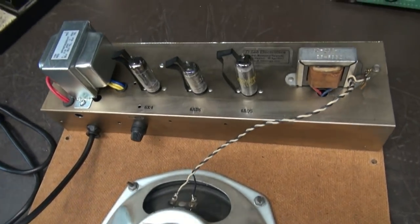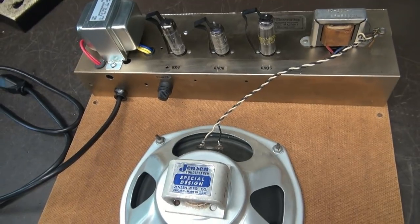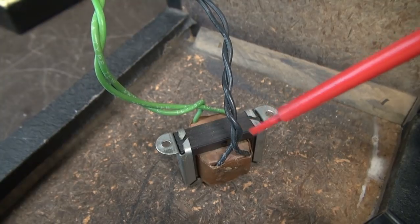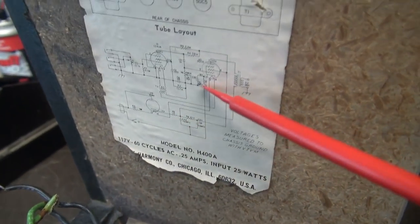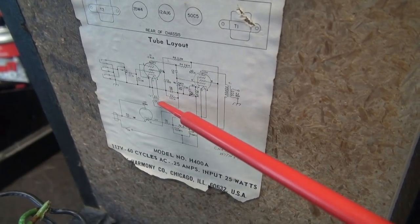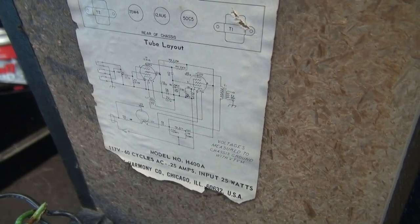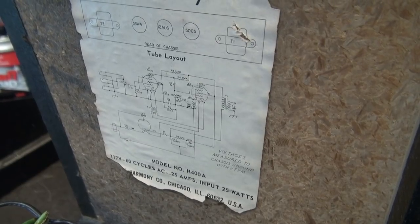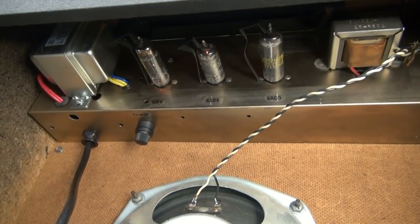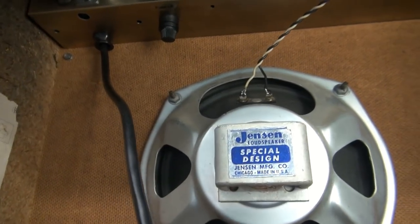There she is mounted back on the speaker board with the new labels on there for the tubes. Thing looks great. Follow-up note: that mystery transformer I told you about that I took off the chassis — it was actually on the schematic. There's the old 12AU6, and they had a separate little filament transformer there, obviously to reduce noise. But we don't need that anymore because now the main transformer does it all. There's the chassis reinstalled, and you can see it almost looks like that transformer belonged in there — it really came together well.